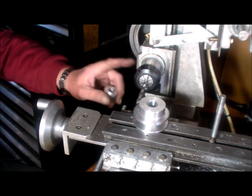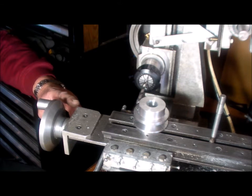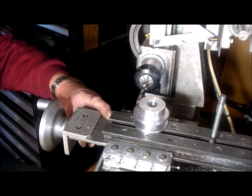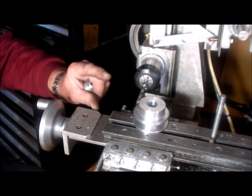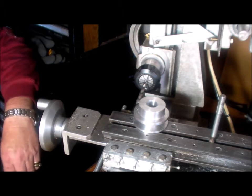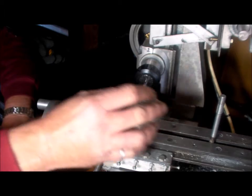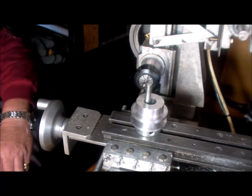So 21 millimetres, centre of the spindle to the work table. And this is the temporary work table. The permanent work table is another 10 millimetres higher, I think. I think the bed is 12 mil, and the permanent work table casting is about 25 mil, so probably another 12-13 millimetres higher, which would give a lot smaller gap here. So at the present moment I need to space it up, so I have a collar. And I can now do the job.